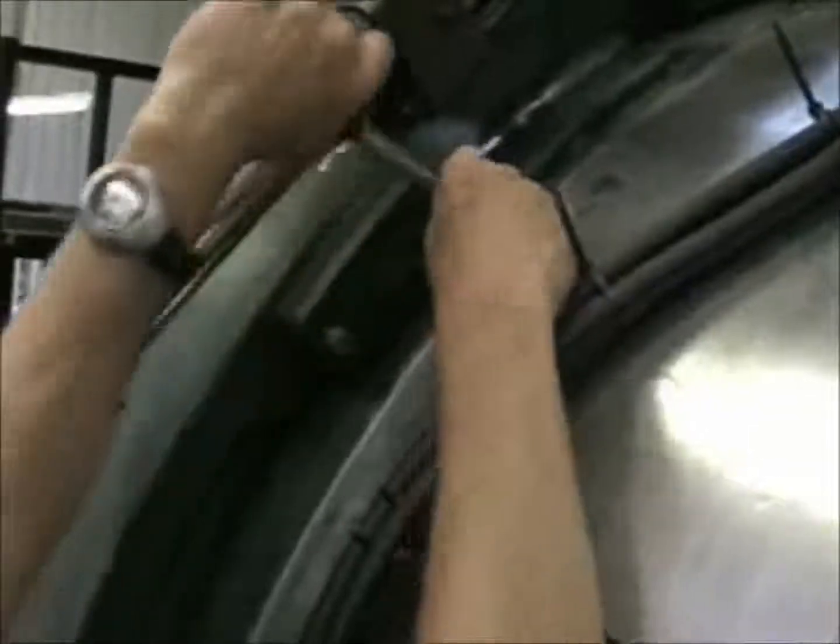And tighten the bolts. You'll have best luck if you start by replacing the glide blocks on the top first. In the remove position of the lock ring, the glide block may be past the flat bar guide that's tacked to the vessel ring. So the lock ring may need to be pried forwards gently so that the glide block can slide past the end of the guide.